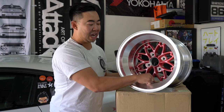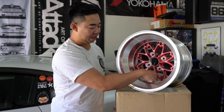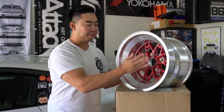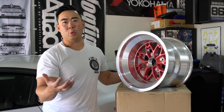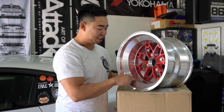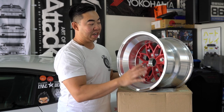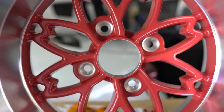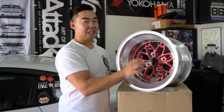The valve stem is a short nib that comes straight out, so a racing-style gauge with a thick fitting might be difficult to attach. On the lip, a lot of modern wheels do fancy two-step or flowing lip designs — like Volk's 21C and 21A which do crazy step lip things — but this wheel keeps the lip old school style with really hard right angles. It's got a big dish, then goes 45 degrees down, with a second step, polished end, and a small catch edge for the flange. With so many flat facets before reaching the minus 32 offset, the light hitting that flat piece of metal makes the lip look insanely deep.